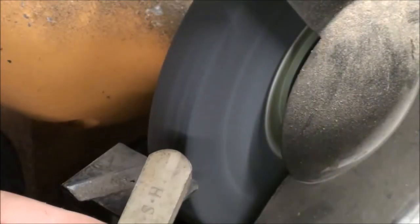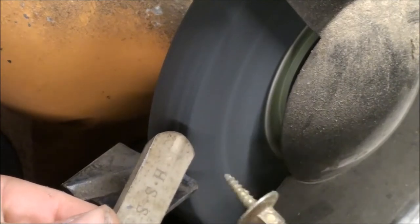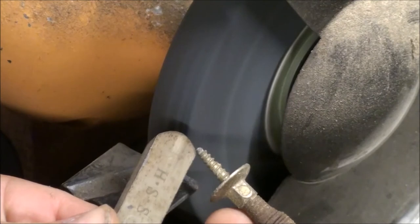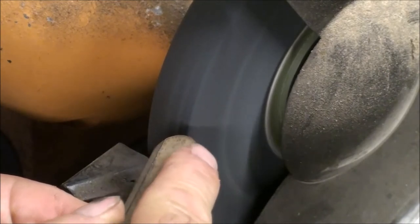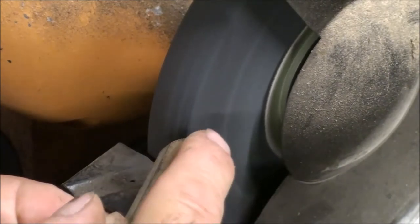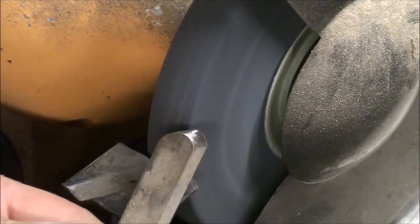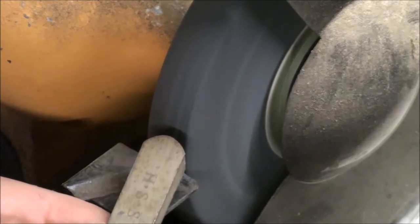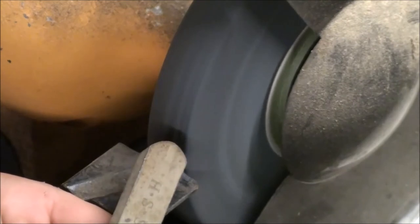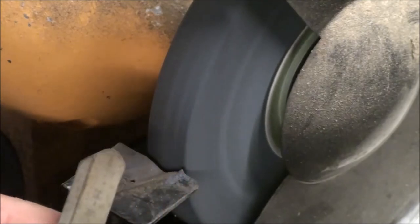The other thing worth noting, when you're sharpening a tool, is that the very edge will start to turn up. There's a little bit of material that turns up, so if you rub your hand across the top of there, it grabs just a little bit, and that tells me I've got a pretty good edge going. That's always been good enough for me when it comes to turning a bowl. I notice the shavings come off a lot smoother. You get paper-thin shavings that come off of here when you're making a bowl.